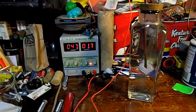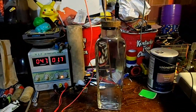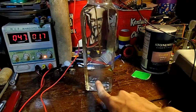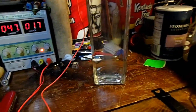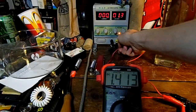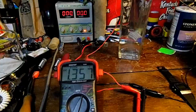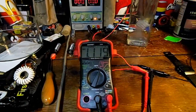After about 15 minutes, it's settled down to only pulling 47 milliamps from the charger, which means it pretty much isn't charging anymore. Just like last time I built an Epsom salt battery, it has a white shadow of particles falling off the copper, but nowhere near as much as the sodium chloride battery. Bringing the voltage down and disconnecting — it's been about 15 minutes and the battery is hovering around 1.11 volts.